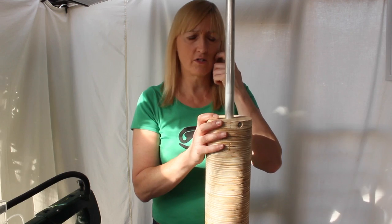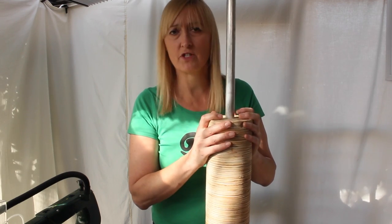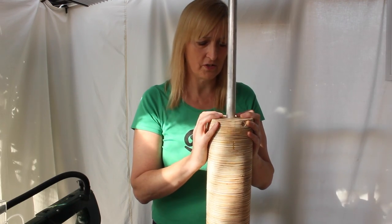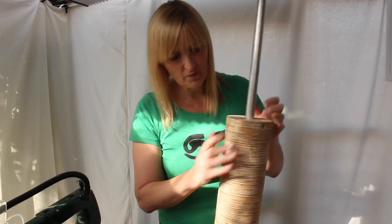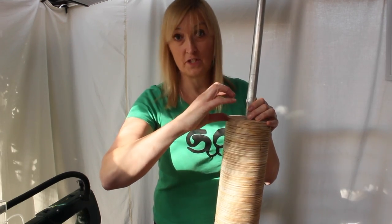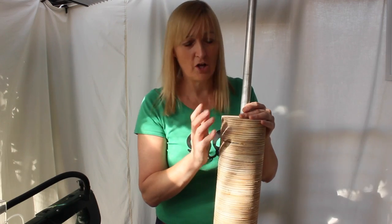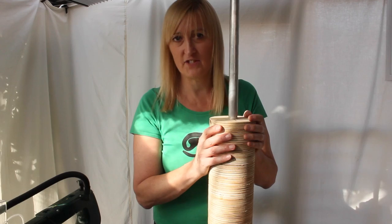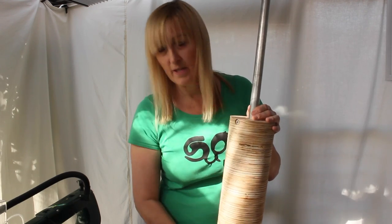In case you're wondering why 127 millimetres, I'm wondering that a bit too, but it's the diameter of the jet sander that I was basing this on. I originally said Axminster sell them, it's by jet. This is a little bit narrower, this is 50 centimetres, whereas the jet is 56 centimetres. So even though I'm matching the diameter, I'd still have to cut any sandpaper down that I get from them, but you know, I don't know how close the fit would be anyway if I bought their sandpaper. I think it's going to be easy to do my own, just get a roll of cloth-backed sandpaper and use that.